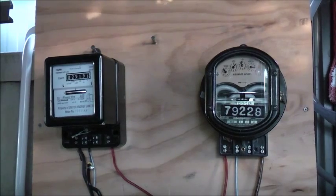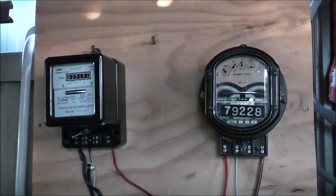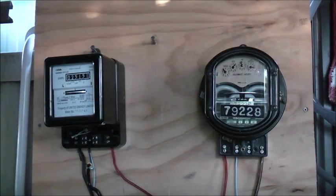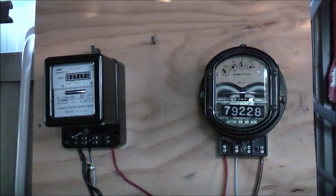Anyway, let's finish this test off. We'll get halfway through, so we've got another 200-300 watt hours to go. As you can see, there's no load, and that disc moves. I'll have to look into that. Load on, the disc's fine when there's no load. This wants to rattle and clank against those magnets. Oops, don't want to go too much. 41 amps on the BAZ.